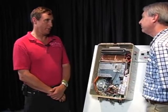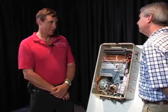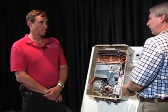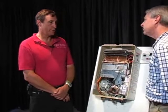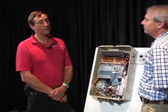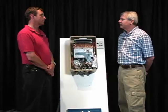It's not going to hurt the unit, right, but an inspector will look for that. For liability reasons, if you see something written as required in the label, typically you're required to. And as much for warranty reasons as anything, because if it says it on the side of the unit, then the manufacturer typically requires that to comply with the warranty.